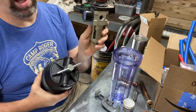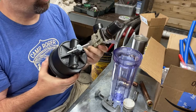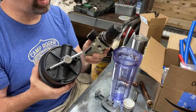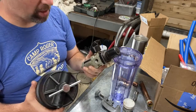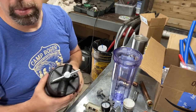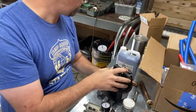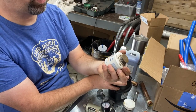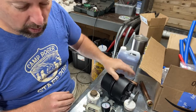I'm going to add a regulator with a final dryer on the end of it, simply because that's what I have for painting. I think I'll need 20 to 30 PSI, not the 125–140 PSI that's coming into the system. Then I'll simply have a quick disconnect after that. I'm connecting the various parts with black pipe fittings and a couple of copper fittings. I'm using a Teflon thread sealant — thread sealant with Teflon made by Permatex — just to help seal it up because I hate air leaks. I'll show you what it looks like when it's put together.